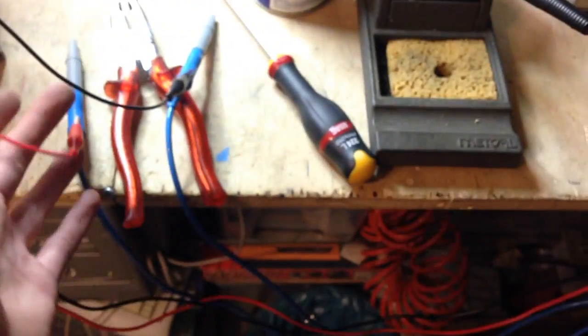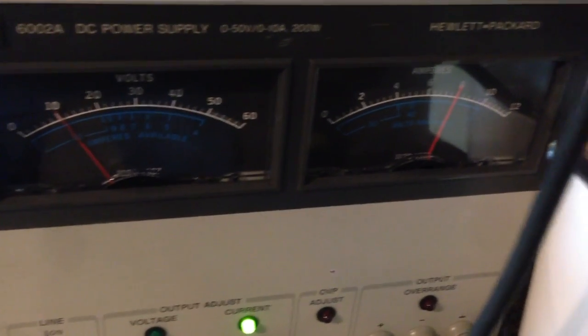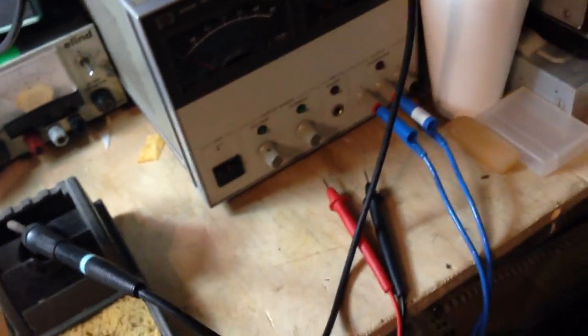Let me just give you a quick demo. I've got it plugged into my beefy benchtop power supply. I've measured with the battery installed, and the motor runs at about 13 volts. I'm not going to go up to that because I'm really saturating this supply and I'm using very wimpy cables. But as you can see, now it's set to 10 volts — just look at the current needle. Almost 8 amps at 10 volts. That's a real beast of a motor.